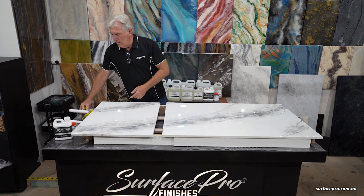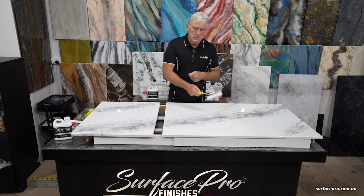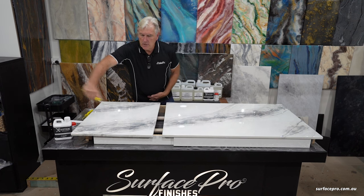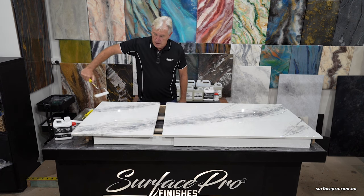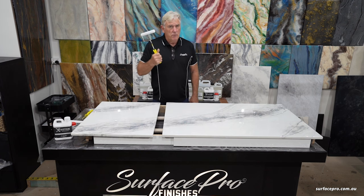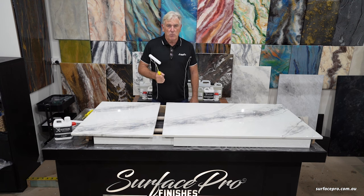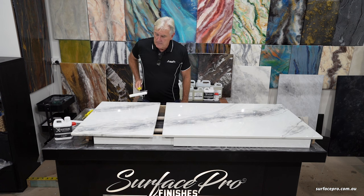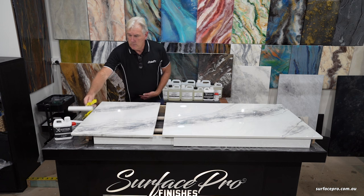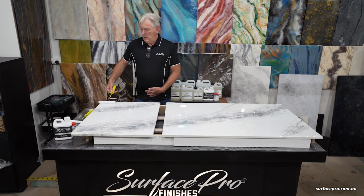So, assuming we've made up our X-Factor and it's ready to go, I'm rolling this roller in the X-Factor, charging it up. I'm then getting it out onto my board, backwards and forwards, and I can cross-hatch it to get a good coverage. You don't want to flood it, but you don't want just a very minute amount either. You want to get a reasonable amount on the roller. Roll it out backwards and forwards, then finally with the wet roller, you are drawing it back like this towards you in one motion.